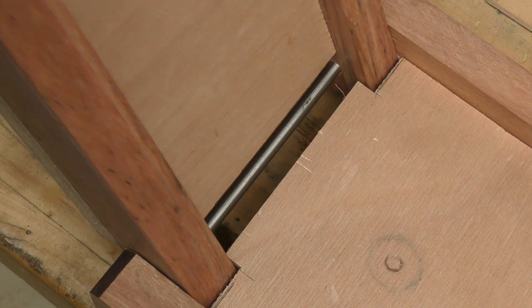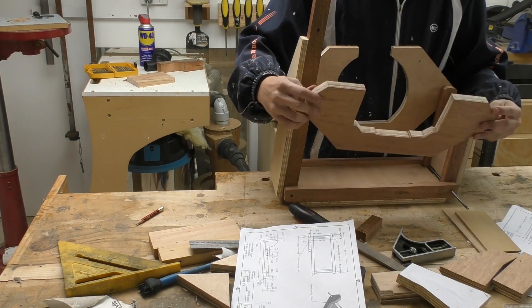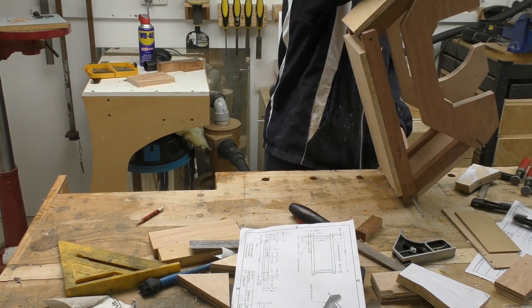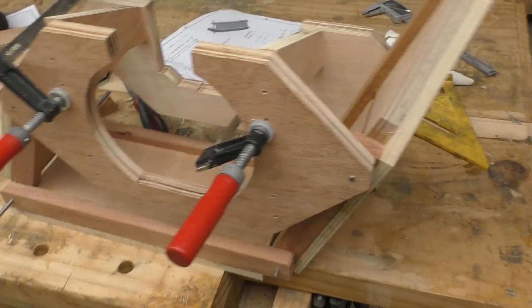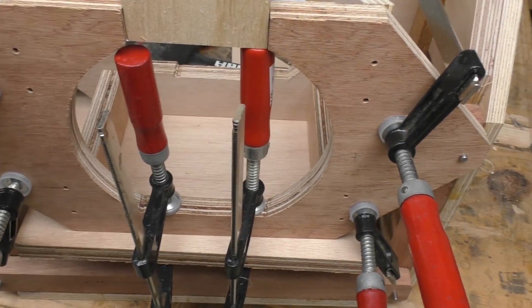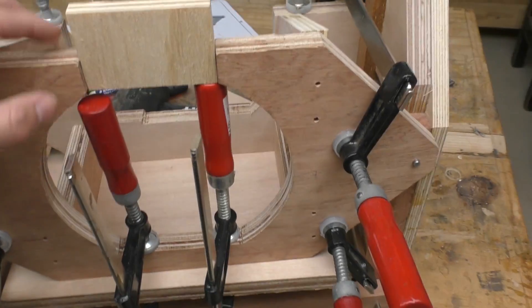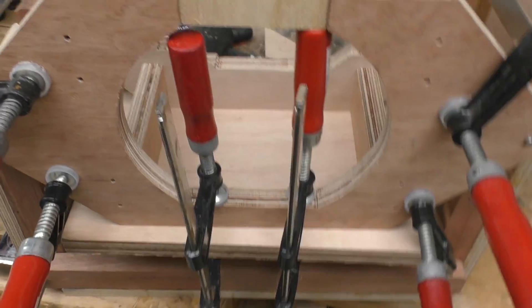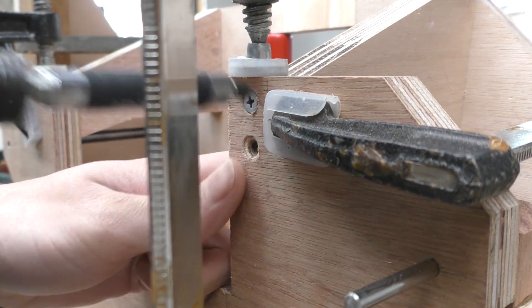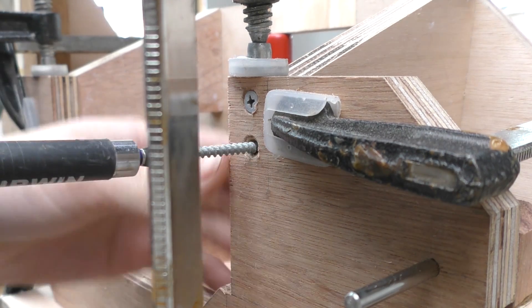Just clears — just clears. This seems to work alright, so now I have the confidence to actually screw these pieces down. I've got everything clamped up with a piece of plywood at the bottom to prevent twisting and another block of plywood at the top to prevent the whole thing from collapsing on itself. If anything comes out unsquare I should be able to adjust it since I'm only screwing it together.